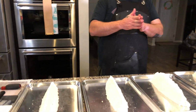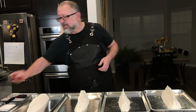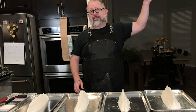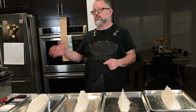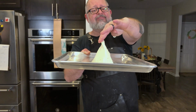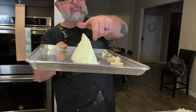Now, as you learn to sharpen a knife, you're going to take the stone and the knife, and as you push back and forth, you're going to kind of tether the end of the blade. And as metal comes and hangs over at the end, after you've used stone after stone, and if you don't know what I'm talking about, I'm going to put a link up here in the description on knife sharpening basics, because when you get to what we're talking about, you have sharpened your knife, and now we're going to go into stropping. So in the end, you're going to end up with an edge that has metal that's hanging over, and it literally flips back and forth, okay? We don't want that. We want to rip it off, okay? We need this burr to come off.